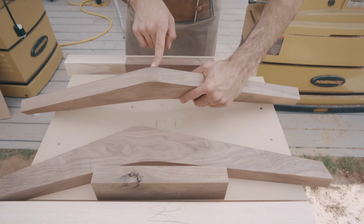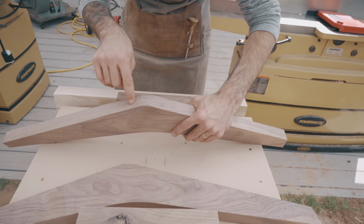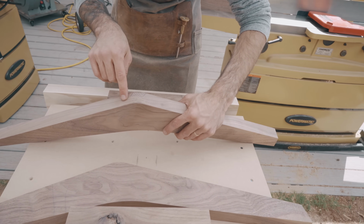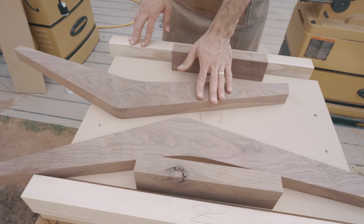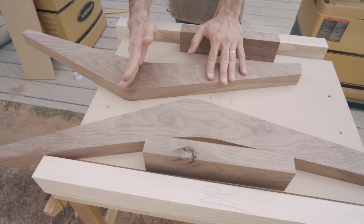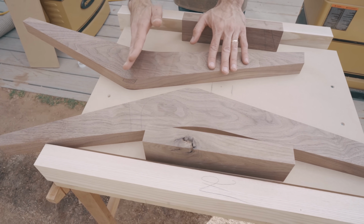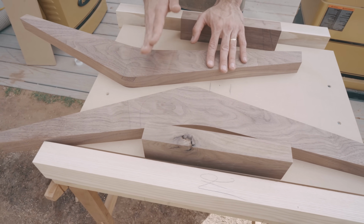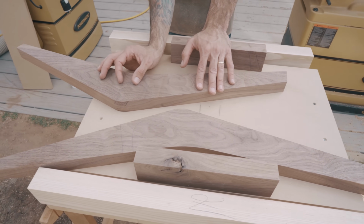Right, and you're having to remove it at an angle as well? Yeah. That's why, see how it's angled? Yeah. So 12-degree angle, and I need a flat bottom. Forever. To do that by hand, you have to have your hand saw at a 12-degree, and then just carefully do that, and then carefully do it again at the exact size, I guess. Yeah, you could do that.